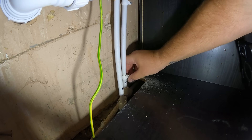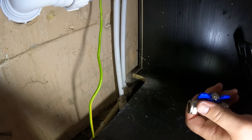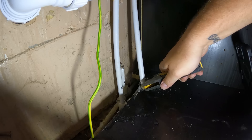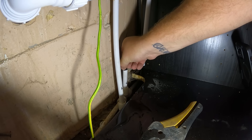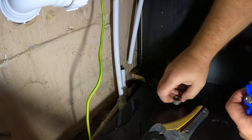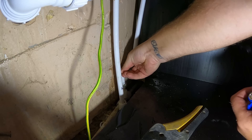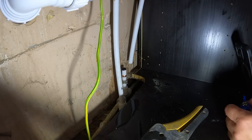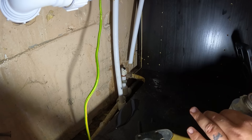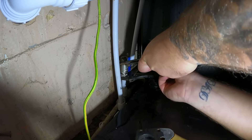We've marked on the bottom hot and cold. I've just pulled the cold away from the wall, we'll take the clips off it, cut the pipe and pop on our hot and cold valves. So we get the cutters on and get this plastic speedfit — or JG, or whatever it is — cut out of the way. A little bit of water there but we can just mop that up, no problem. Make sure you get the inserts in and push them right in — these inserts just keep the outside of the pipe solid when you put the compression fitting on. Get the nut on, get the olive on, and put a little bit of paste around the top. Interestingly, some people have said the paste I'm using is no longer WRAS-approved or something, so I'm going to go find out more about that — it's quite interesting how pastes can go out of approval. So we get the first full-bore butterfly valve on there, then we'll do the same with the hot.